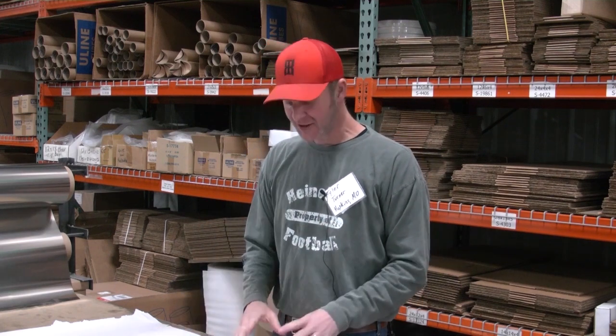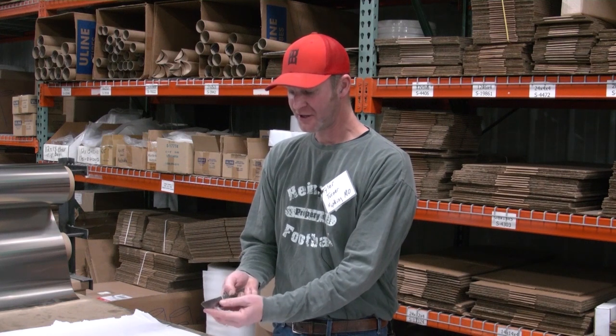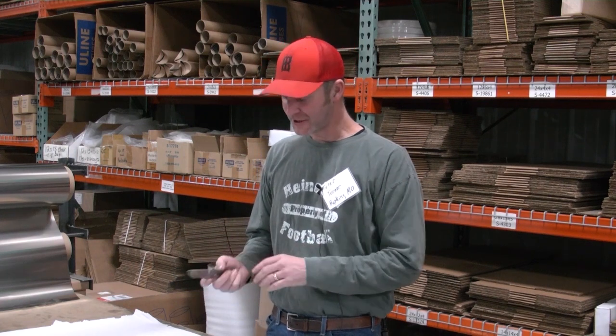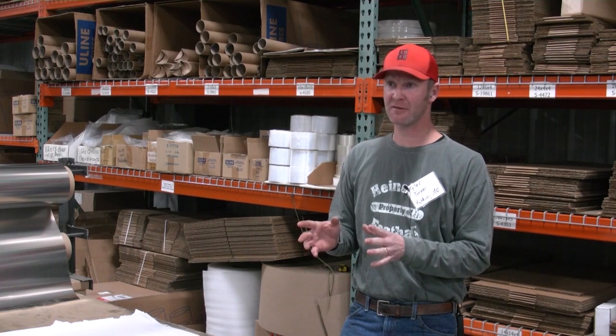So go back in, grind some more, and whenever you can open that up and it'll just barely catch, just engage like that, stop right there. Just stop. Don't go anymore. Don't get greedy and think it's not enough. You're gonna hurt yourself, because you're gonna grind too much. So at that point, stop and carbonize your lock face.